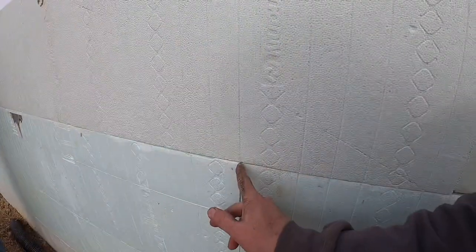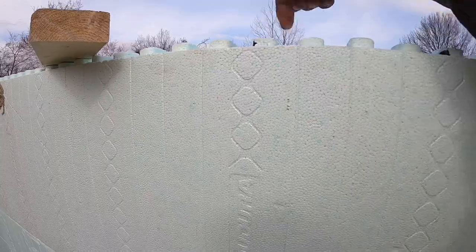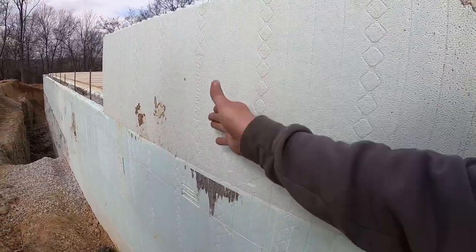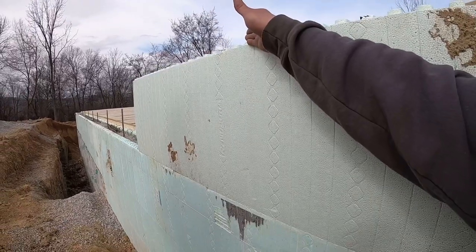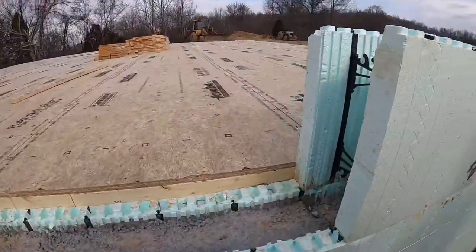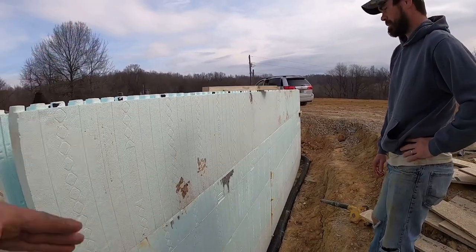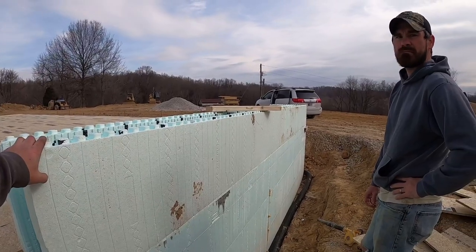So basically we're able to transfer this common down because this block was actually cut on the line, which means the nipples still interlock but the studs don't line up. So this will be okay for a short period of time until we get to a window, and basically either right up the side of the window works best, the center of the window second best. Just kind of have to see where it falls out at. On the outside, I shouldn't really mess with the siding guys a whole lot because they can actually see the studs as they go up. So if they got offset there a little bit, they'll be fine. Just makes the stacking process a little bit easier for us.